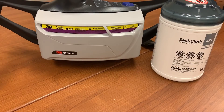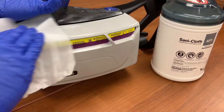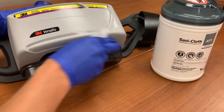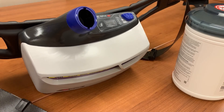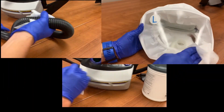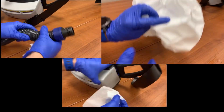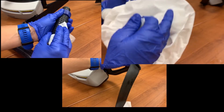When you are finished using your PAPR, it will need to be cleaned. Using the gray top wipes, clean all exposed surfaces of the unit. Be sure to use a new wipe for every area. Remember to not only clean the unit itself, but also the belt, breathing tube, and mask. If the breathing tube is encased in a cover and the PAPR will continue to be used during that shift, clean the cover and leave it in place.